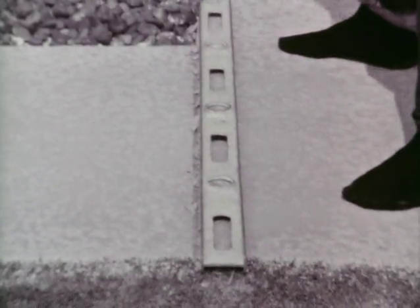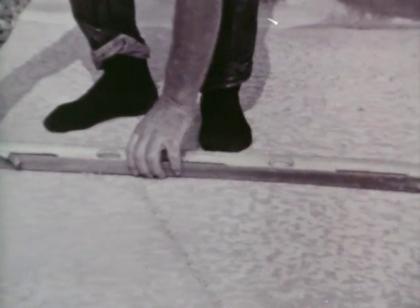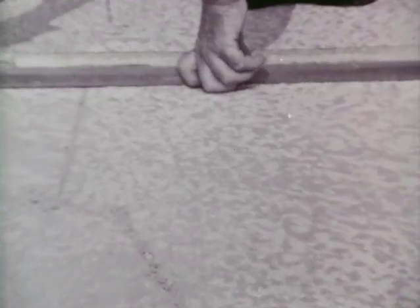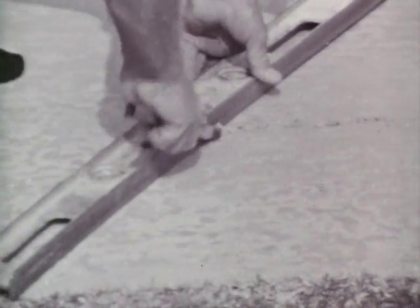Knifing or stone cutting. Lay the open end knife almost parallel with the deck and cut through, exposing the gray base concrete fat, similar to a mortar joint. Knife along the straight edge or cut at random. Flagstone effect is popular. Do not sweep away knifed out chips until deck is fairly hard. Sweeping when the deck is soft will cause scratches.